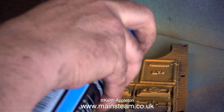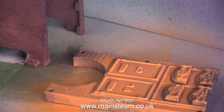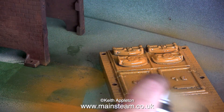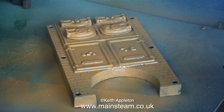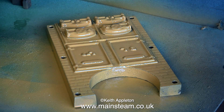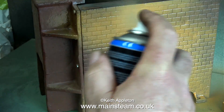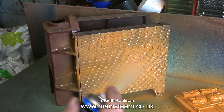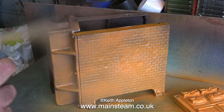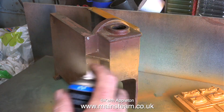When repainting old parts, particularly over existing paint, you never know whether the paint is going to react, but the good news is the paint I'm spraying onto the boiler is not reacting with the paint underneath. But then when I spray the red primer on, is the red primer going to react with this paint? We shall see. If anything like that happens then I will take the boiler casing parts to the steam workshop because they have a shot blasting cabinet and with Simon's permission I will use that to take it back to bare metal. But it's looking good so far — I think it's going to be alright. It's most important not to get any runs or sags in the paint so I'm using light coats and plenty of them.